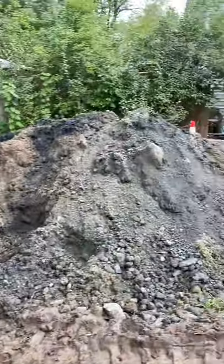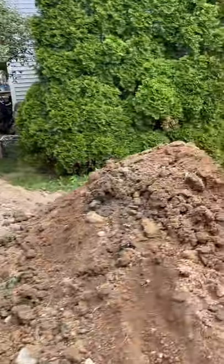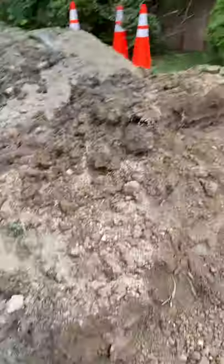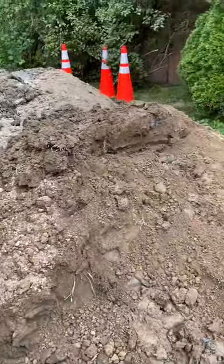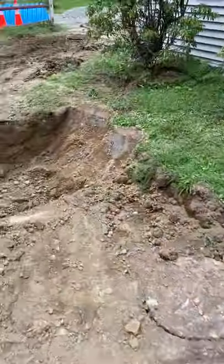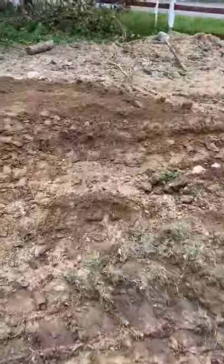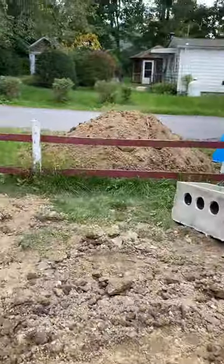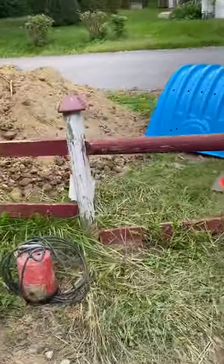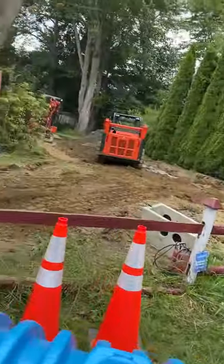When the job is all finished and you bury all the bad stuff in the dirt — that's how you fill your holes — then you come back with the topsoil, the stuff you pulled off the top layer, and you use that to cover the ground so you can rake it and make it look decent. We actually have a pile up by the road; we don't even want it on the job site. When we're all done, we come by and scoop it and spread it out.